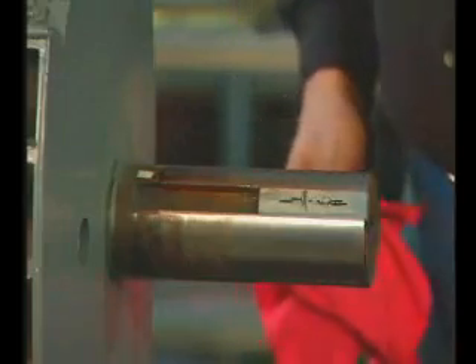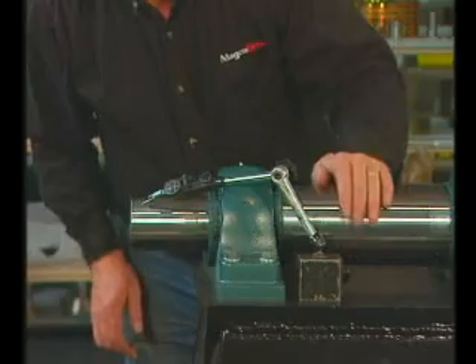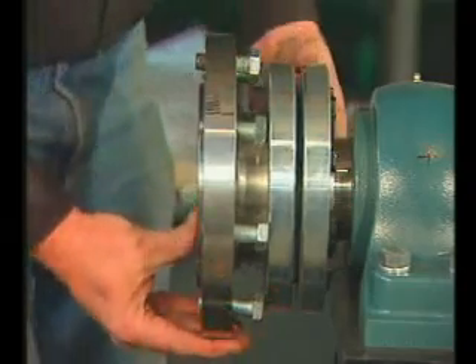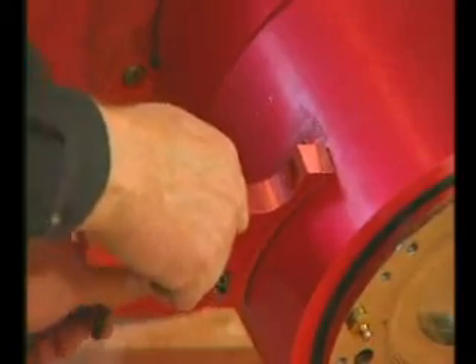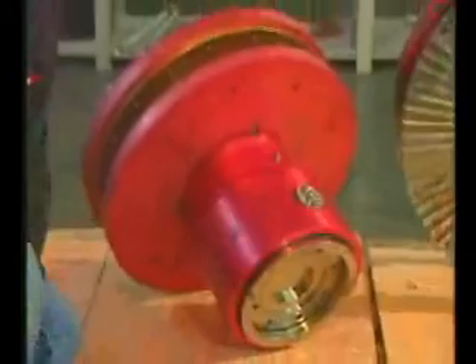This is to ensure proper torque transmission between the shaft and the hub. Measure motor and load shaft runout and end play. Test fit of the hubs should be done at this time. The hubs should be free to rotate and slide once aligned. For ASD sizes 22.5 to 26.5, remove inner and outer actuation arms. This step is not required for sizes 10.5 to 20.5.